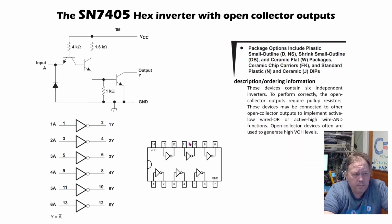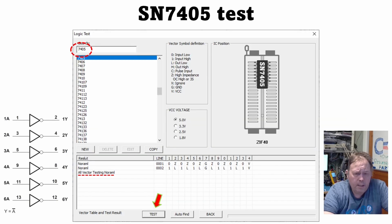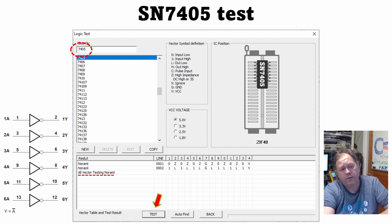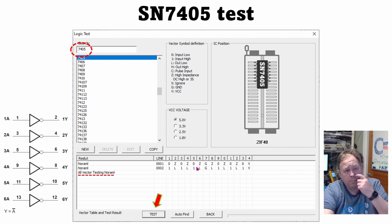As we saw earlier, the 7405 has the same pinout and almost the same kind of output as the 7406. So how does the MiniPro programmer differentiate and see what chip is connected? Because the MiniPro programmer only detects the levels. No timing or other things are involved when the programmer detects if a chip is bad or not. It is this truth table, where it tests all the variations on the inputs and outputs on the lines, that determines if a chip is good or bad, or does the auto detect.